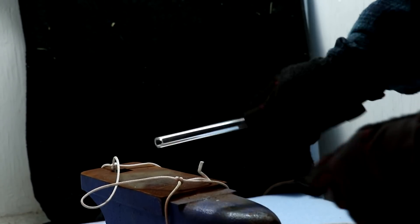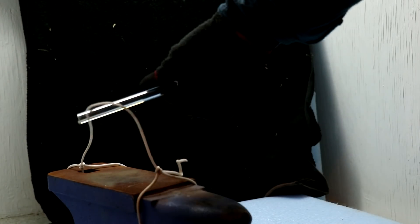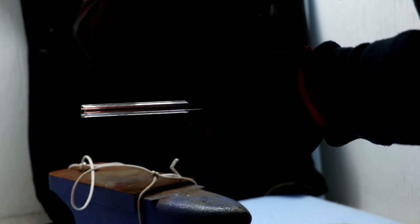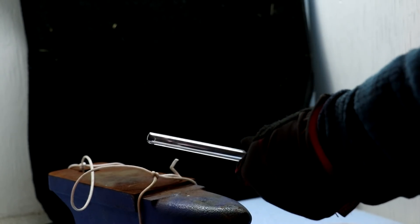Let me attempt to explain what's happening here. This is a piece of normal, untempered glass tubing. If I loop it through this string, grab hold of each side, and lift, you can see that the glass is able to support an anvil. I'm putting a force on this side of the glass — that side is becoming under compression, the force is pushing the glass together. On the other side, the glass is being put under tension, the glass is trying to be pulled apart. But as long as I don't overcome the tensile strength of the glass, it's able to hold the load. Glass is fairly strong and rigid that way.